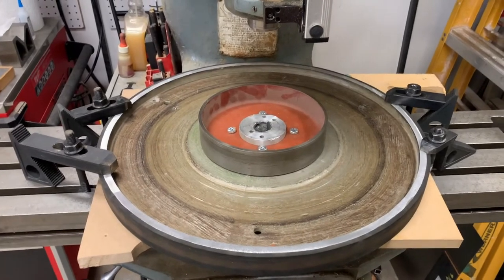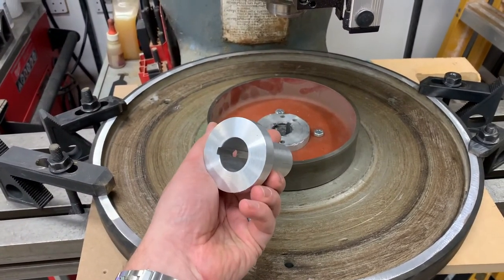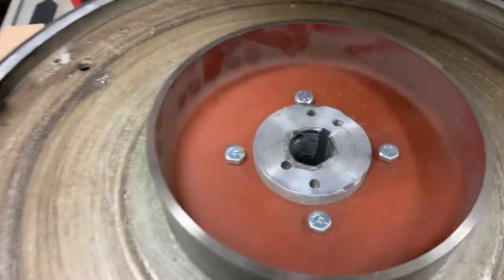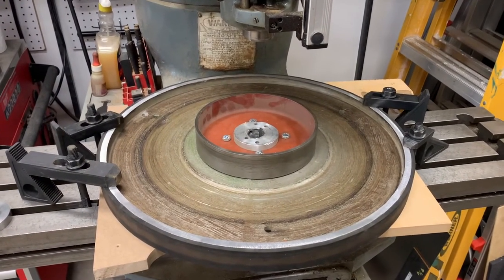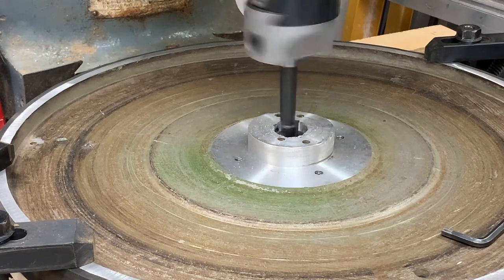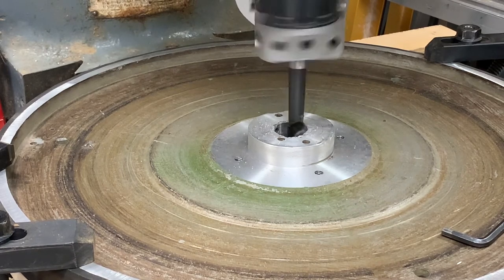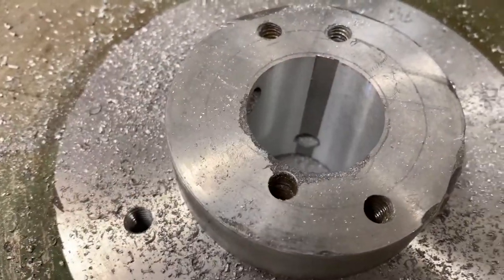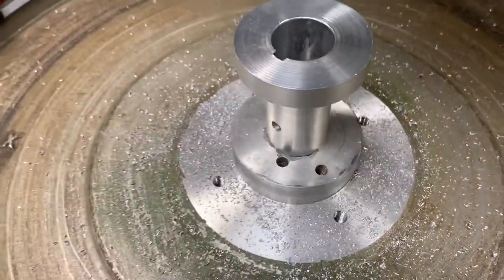Here's our lower bandsaw wheel. If you remember, the problem was that this hole is not concentric - it's all beat up. Here is the sleeve that we made to fit in there. This fits tightly on the motor shaft and it's a nice finish so it's very cylindrical. We've got the wheel mounted on the milling machine, all clamped down and indicated so we're in the right place. We're going to put the boring head in and make a hole. Here's the final bored hole - the finish looks really nice. We've got just a little bit of the original keyway left, which doesn't matter. And our sleeve with a little tapping should go right in.